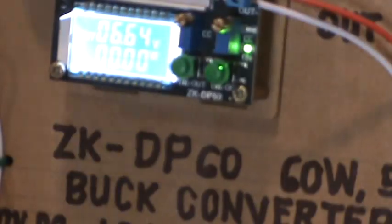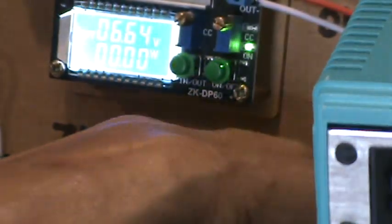This will be an AM FM radio in combination with a tape player. The power supply of this one, I converted it to DC, so it has a red terminal and a black terminal. I put a high frequency capacitor here, so we could eliminate some buzzing sound. This will be the connection going to the plus and minus. Okay, I will now put my AM FM receiver here. The green one is connected to the positive terminal.